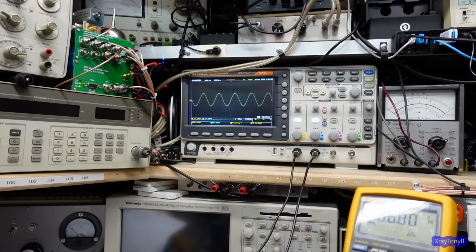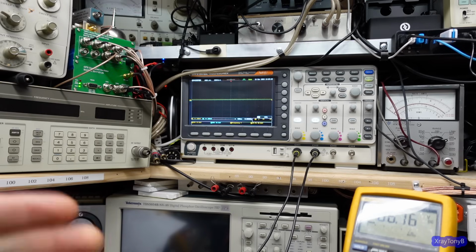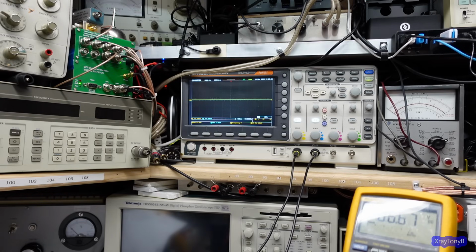Right now we're looking at about 185 millivolts RMS. So that's just a very tiny signal. If there's no crossover distortion there, we're just not going to have any crossover distortion pretty much. So it can idle at that real low current like that. And it appears, with transformer loss, idle current of the outputs, everything all told, it's drawing 1.4 amps, including all the losses on the bench and everything. That's not bad.